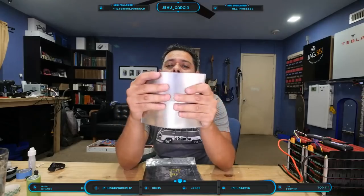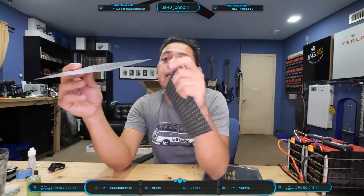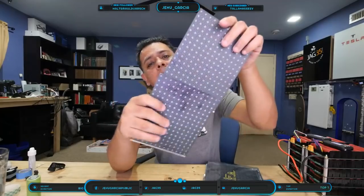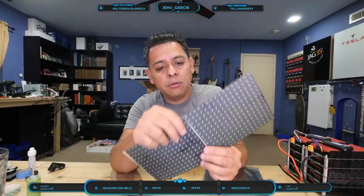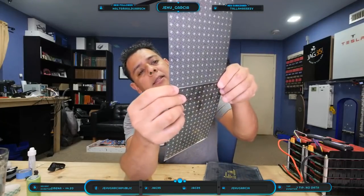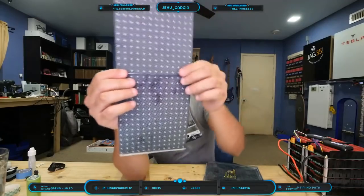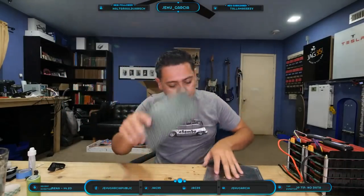I originally got some of these because I thought maybe I can put some on the bus, on the roof. But then I thought maybe I need to make a video and see how hard it is to make these, because I don't think you need tabs. It has 2 layers, and the bottom layer is like the negative, and the top layer is like the positive, something like that. So then you can just put them like that, and you put solder there, and then you put heat on there, and the top layer attaches to the bottom layer, and that's it. They're soldered together, and then this one is in series with this one, and you just go up and you make rows. So they're a lot easier to attach than the other ones. So I bought 10 of them. By the way, you can buy a whole thing of these guys. They're kind of cheap.